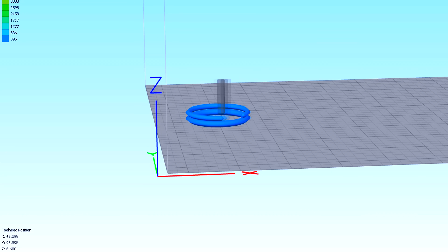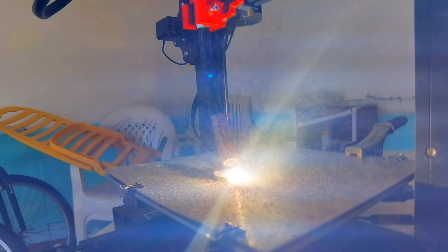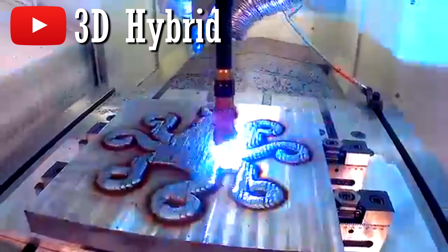Unfortunately, there were several problems I wasn't able to fix. Because the nozzle is angled, it's hard to predict where the metal filament is going to hit. Also, it's not easy to set a correct layer height, current flow, and filament speed without doing a large number of tests, which I can't really do because I would have to buy a lot of sheet steel metal. Even though in the end I wasn't able to 3D print a rocket nozzle with this machine, at least I learned a lot — for example, I learned that this machine is able to weld better than me. To be fair, this idea is not as crazy as I made it out to be, because you can easily find videos of welding machines strapped to CNC machines doing exactly what I was trying to do.